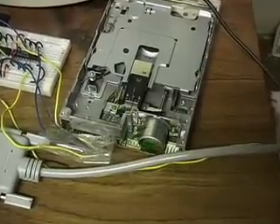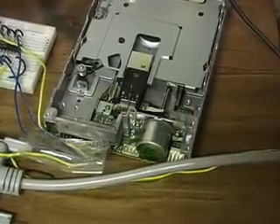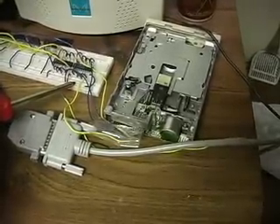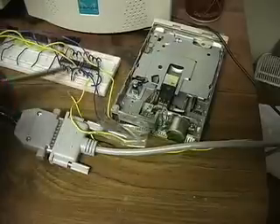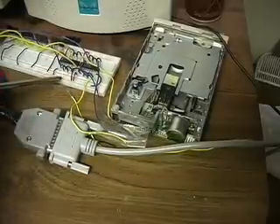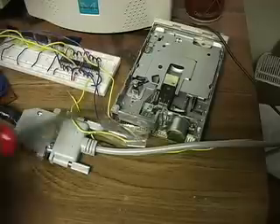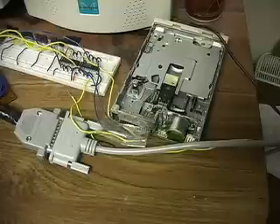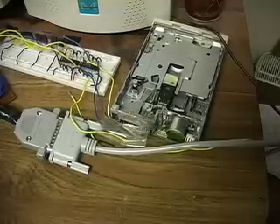The driver is actually kind of interesting. I've got two buffers set up, and you're not supposed to ever hook up the connected outputs of TTL, but I've got the inputs and outputs of four buffers for each line hooked up to each other, so it's actually supplying a lot of current — enough current to drive the 4-wire stepper motor. It was a lot of fun to put this together.